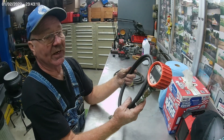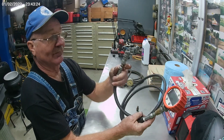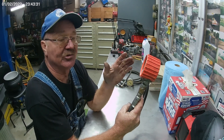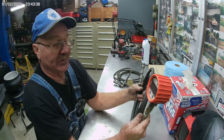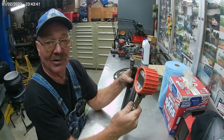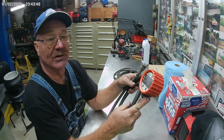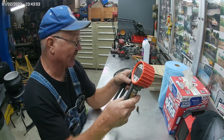This digital gauge is nice but it's expensive, and I've got a quick coupler on it too. This thing goes from 5 pounds to 10,000 pounds and it's accurate just about everywhere you use it. I check case drain pressure with it — case drain pressure is usually like 3 pounds. It's good no matter where you're at in the scale, from 5 pounds to 10,000 pounds. Accuracy comes with the price.